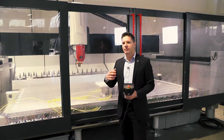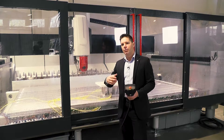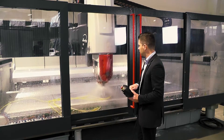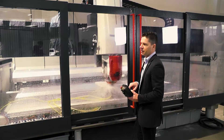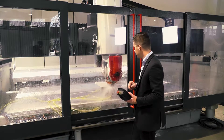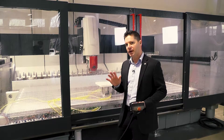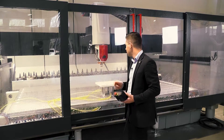Keep in mind this is a first original setup, so this process is a little bit slower. Down the road when you rerun these footprints, it'll take less than five minutes. Now we're coming into position four profiling tool, easing it in — sounds good — and running at full speed. Position five diamond is next. Diamonds are a little safer, which is why I highly suggest going to a five diamond setup rather than four diamond and three polish. With five diamonds, most colors will be fine with one polish, though darker materials may require a second polisher.